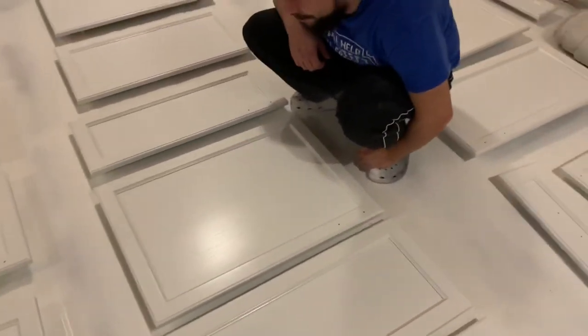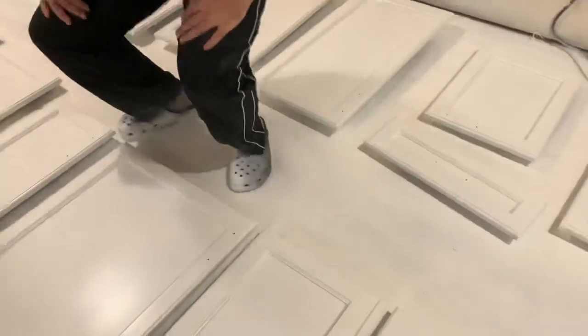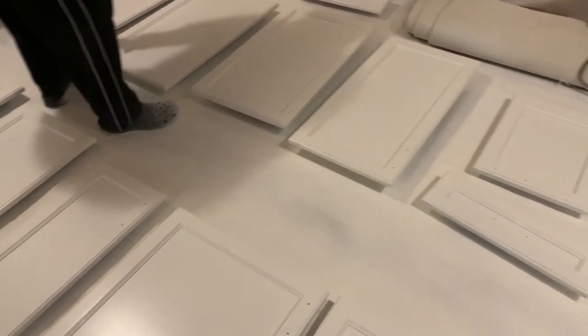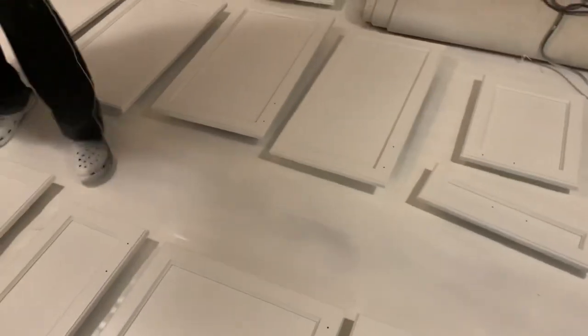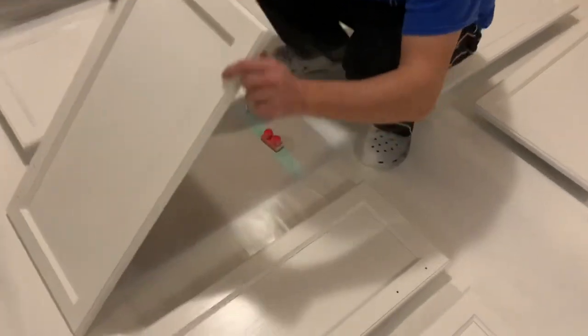The other problem we ran into was the fact that our doors are oak. Most people will put a skim coat of wood filler on their oak doors so that when they paint, the paint goes on smooth and there's no grooves or bumps. We didn't want a smooth finish like, you know, IKEA furniture. We wanted it to look like oak and real wood because they are real wood and we love that look.